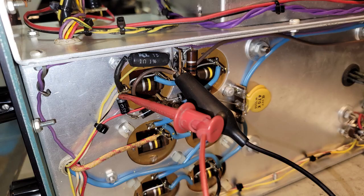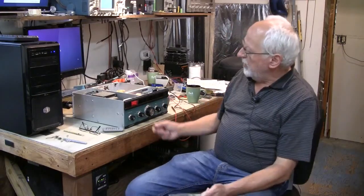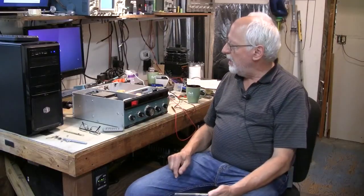The whole purpose of this setup is to inject 500 milliamps across the current sensing resistor so that I can get an indication on the panel meter and calibrate it to match the Dynascan analog meter. The resistor I have selected in my resistance decade box is 25 ohms 20 watts. I turn the voltage of the variable power supply up to roughly 10 volts and end up with about 500 milliamps of current flowing through the current sensing resistor. That creates a voltage drop across the resistor, which indicates at the panel meter on the front of the linear amplifier, and is calibrated with the potentiometer for the plate current. Put the rotary switch into the plate mode, send your current through that resistor, it creates the voltage drop, calibrate the pot — done.